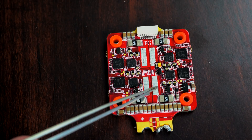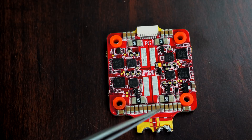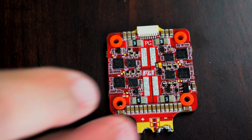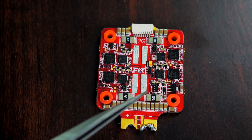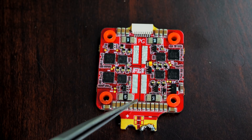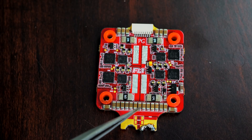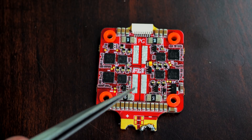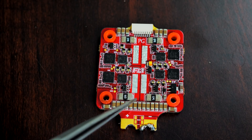If you look here, we have these pads — people probably wonder what they're for. They're actually providing higher power rails so things like that won't happen. We're putting lots of capacitors on here to keep the voltage flowing. It's important that you have a nice thick, heavy PCB, which gives the power many paths to travel and keeps these kinds of shorts from happening. One of the ways we modified this to make it more bulletproof is we rated these capacitors for higher voltage, which actually lowered their capacity but made them charge slower so they can handle power better. BLHeli 32 seems to need this more than BLHeli-S. So the very first batch of our ESCs was more likely to have issues with 6S because of these things.